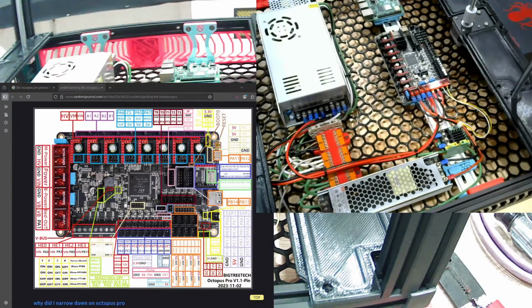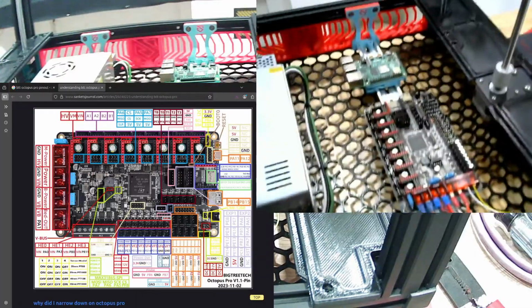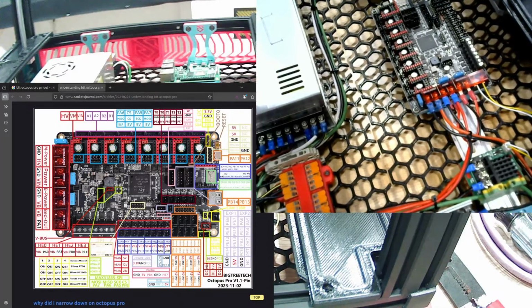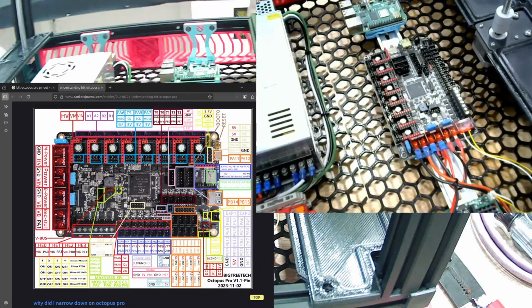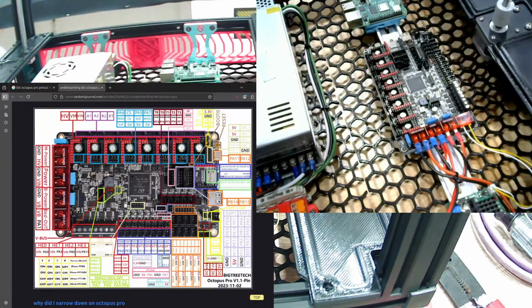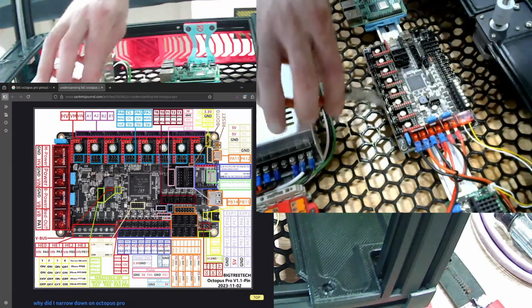So what we're looking at is this one in the corner. You can see my mouse. Oh, come on. Too heavy for the spring. So we're going to set the jumper here. Tiny little pliers. It says if the jumper is inserted on the left, the driver voltage is motor power. It is main power if it's inserted on the right. I'm assuming so. It'll be flipped around, of course, if I'm standing here, to my right.